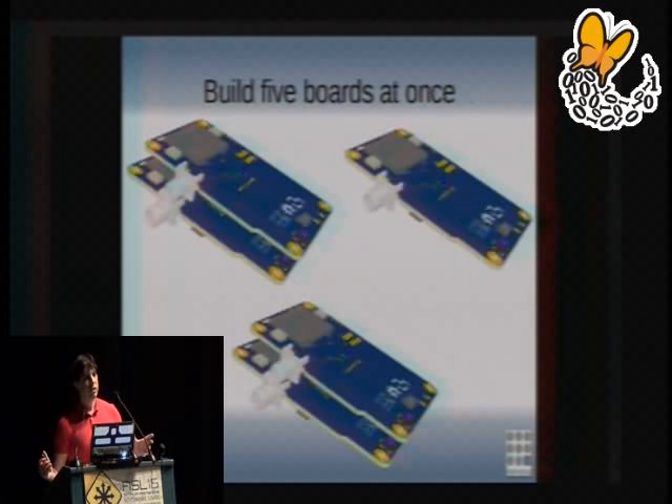When you're building boards, build five at a time. When prototyping, it seems natural to build one, but if you're getting it done by a board house, building one board might cost $150, two boards $152, three boards $154 — so the first board is very expensive and each subsequent board is only slightly more. Build five because two will not be assembled correctly or will not work. One you're going to break — you'll drop it, accidentally delete flash, solder it and it'll come apart. You'll lose one board just out of incompetence. But two will work, and those are the ones you work on while you revise the hardware. Five is the magic number.